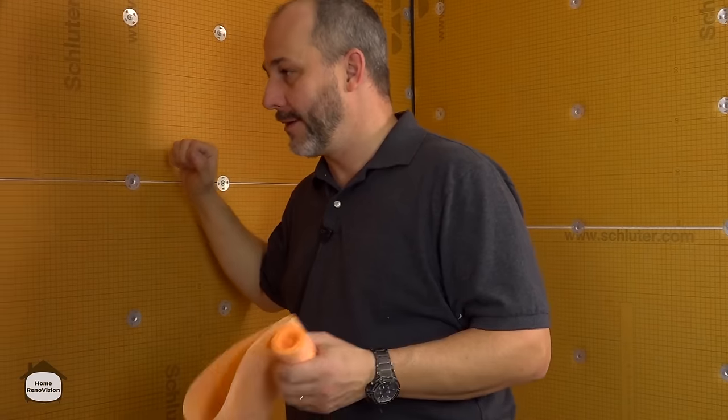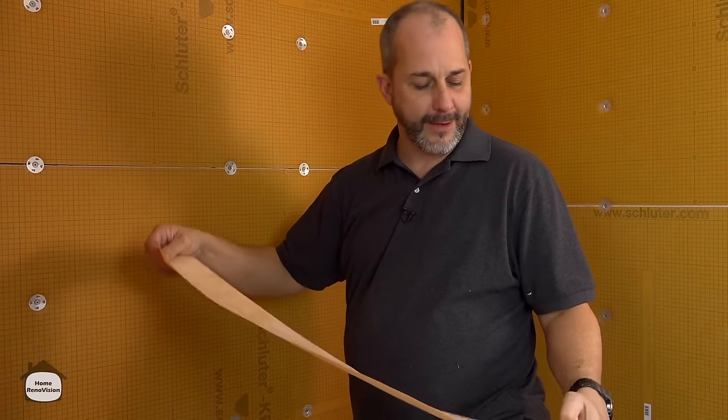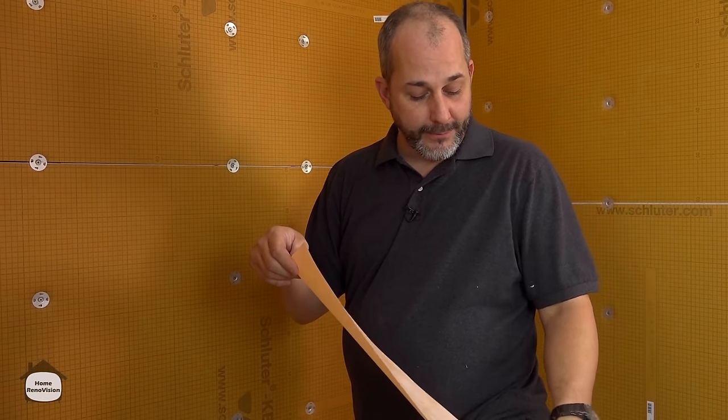Now, you need to use the right kind of cement. With anything that's waterproof, it means it resists water. I want to use a product that is going to get harder and harder over time the longer it stays wet. Since the water isn't going to get absorbed into the wall, I use a non-modified cement, which is old-fashioned for cement. I use that to make all these adhesions because I found that trying to use any other product, it just starts to peel off. So I know Schluter makes their own all-set product now that's good for any application. That's rather expensive. You can just buy a regular, boring, non-modified cement, and it'll save you a ton of money.